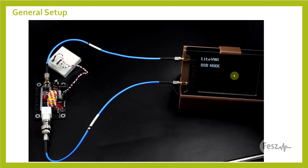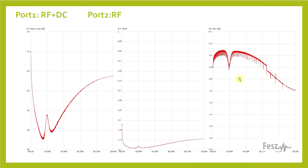I fired up the VNA, connected it to the board, and started going through the various measurements — first the return loss and insertion loss, measured from 500kHz up until 100MHz. We can observe that while right at 500kHz the return loss is quite high at around minus 15dB, it does stay below the 20dB threshold for the rest of the range. A similar story can be said about the VSWR — it stays below 1.2 for most of the range, except at the 500kHz point. For the insertion loss, it's the S21 measurement with a minus in front, so the numerical values are the same. We can see that we are getting pretty decent values, only getting to the 1dB threshold point at the 100MHz mark. So in essence, this BIAS-T is quite well suited for the HF bands.